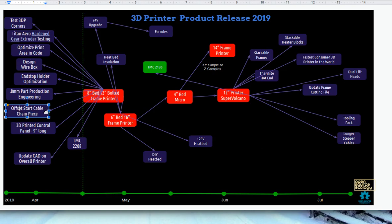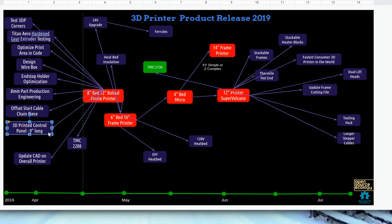There's a slight detail on the cable chain — the first piece in the current version V1902 is just a little misaligned, so just one fix on that cable chain piece. I also want to do 3D printed control panels. Right now we're cutting the control panel out of plexiglass, but there's no reason why we can't print it. That's a perfect use for 3D printing — we get rid of one additional part. The control panel where you have all the electronics might as well be 3D printed, so you can print out all the holes and that does all the drilling for mounting the components. That's a real time saver from a production engineering standpoint.